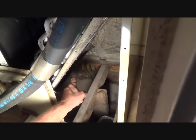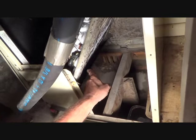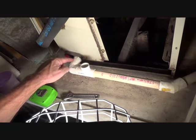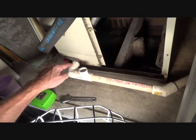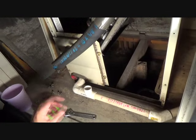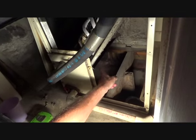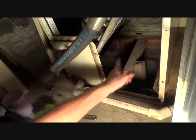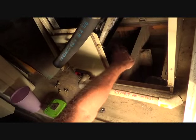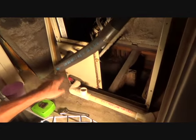If I shine my light up in there, there's a little bit of sludge in there that is going to collect after a while. You're going to form mold in there and stuff like that, and then there's sludge. That could come down through here and get caught in your drain. If it gets caught in there, or you get a mouse up there building a nest, or a mud dauber, or some lint, and it fills this up — chances are this pan could fill up with water because it's not coming out of the condensate drain, and it could come up over this lip and start dripping.